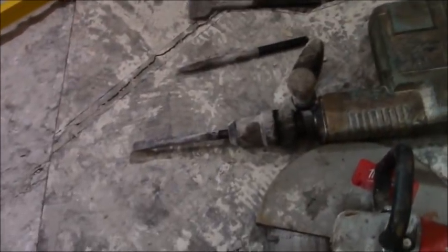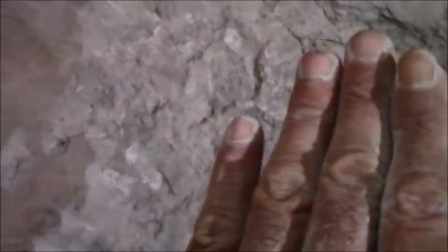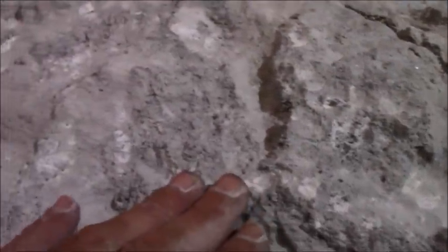You're going to need a jackhammer, and you're going to need different bits. So as you see here, I started making holes in here, so when I get my jackhammer at an angle, these pop up in pretty good chunks. You could just as easily take your saw, which I did, I think, when I was over here. You can cut sections, but you'll have to figure out your depth. And I've had a lot of problems busting through this. In fact, I noticed the other day, there's like hardly any rock. In fact, I'm not even finding any.